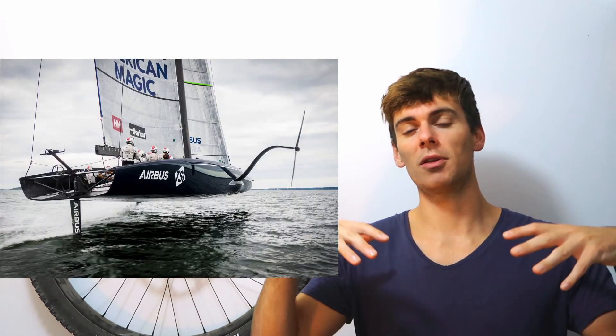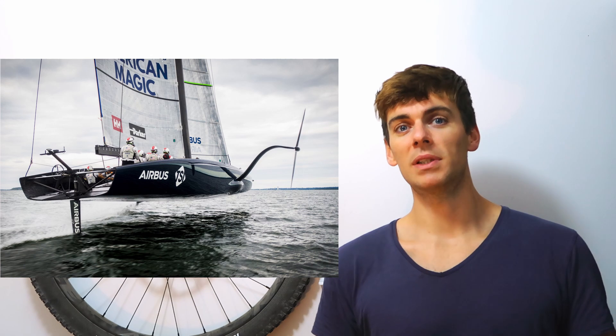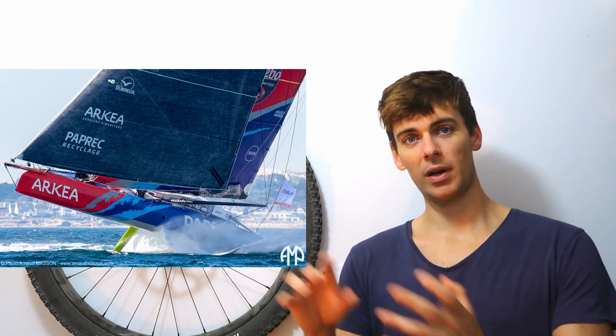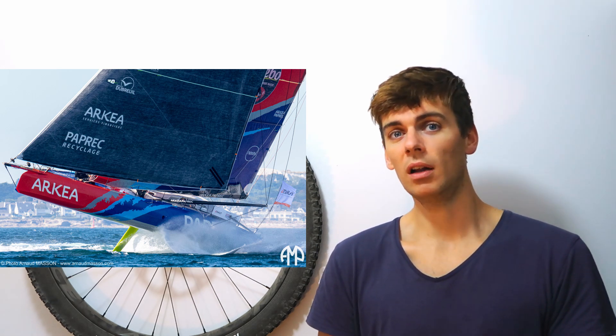The latest generation isn't a full foiling hull like the America's Cup AC75 boats. Those are essentially full-foiling: they have a T-shaped rudder which is a lifting foil at the back, propping the whole boat up with hulls completely clear of the water. We don't see that with the latest IMOCA generation. From a layman's point of view, these IMOCA foiling principles are still very compromised — basically propped up on three legs, one of which is the stern quarter of the hull, which causes a hell of a lot of drag compared to an AC75 which is completely lifted on all foils.